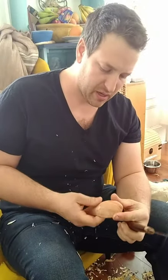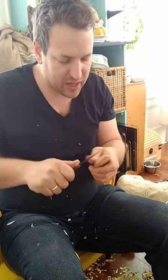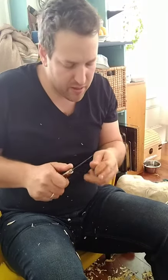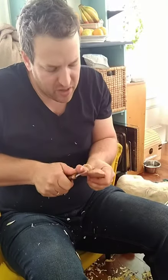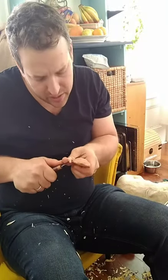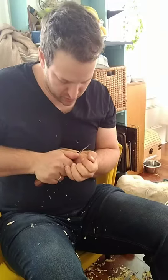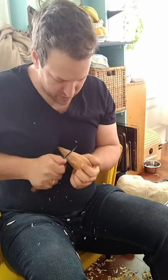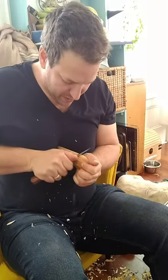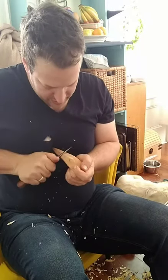How does this feel in the hand? It feels pretty good. You know, I might decide to push this down even further. You'd be shocked at how little depth you need to a bowl if the bowl is properly hollowed out and properly angled to get it to both hold quite a lot and feel quite spacious. So given that it's a pocket spoon you want to ride in your pocket with minimum amount of space taken up and sort of profile there in your pocket, it's useful to pay attention to that.